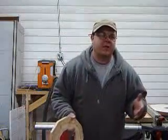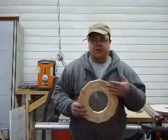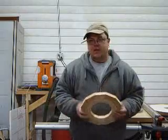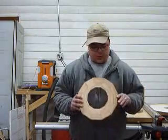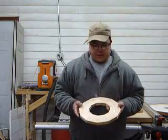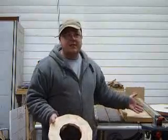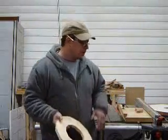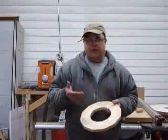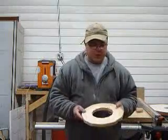Now, one other thing I wanted to mention, and I talked about it earlier in the series, was that I like to use a 12-sided bowl, or 12-sided ring, excuse me. So, why do I like 12? Well, first of all, I prefer to do an even number. And again, that's because when we run it on our sled here, it basically has to be an even number because we have to have 2 equal halves. So that's one reason. Of course we could do 8, 10, 12, any even number.